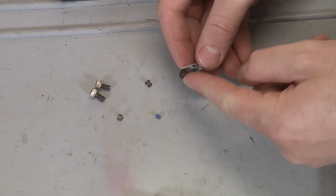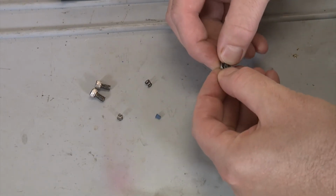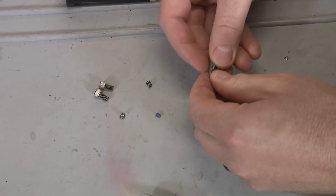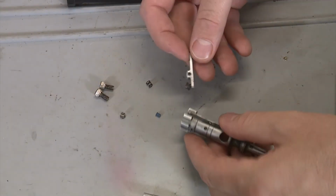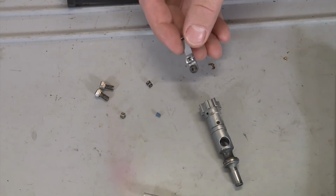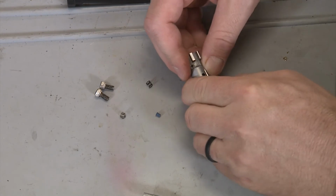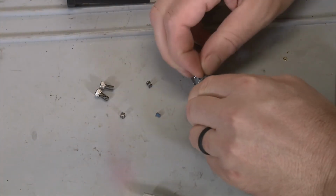This one's got a lot of extra force on it. And we're going to throw this O-ring on here. You say, this O-ring is not spec, but it's overkill. Right, and at least check my extractor hook, make sure it's still sharp. Now, to compress this in place, this needs a fair amount of compression.